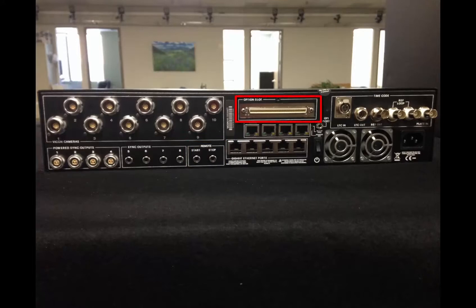You may or may not have this connection on your GigaNet. This space houses the analog ADC card connector. This is a 100-way socket for analog signals. The 100-pin cable used for this port is exclusive to Vicon, meant only to connect to a 64 BNC ADUI box or the supplied patch panel. People use it to collect different types of signals such as EMG, force plates, and acceleration, just to name a few.